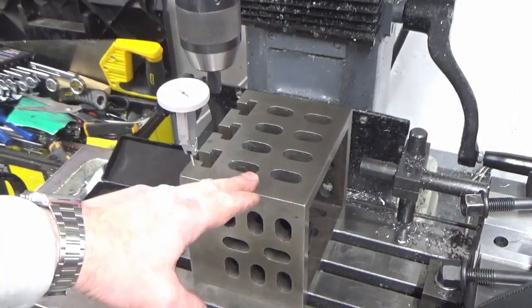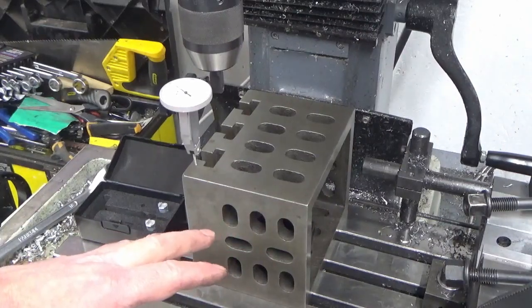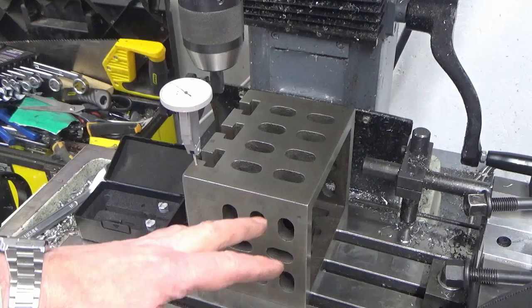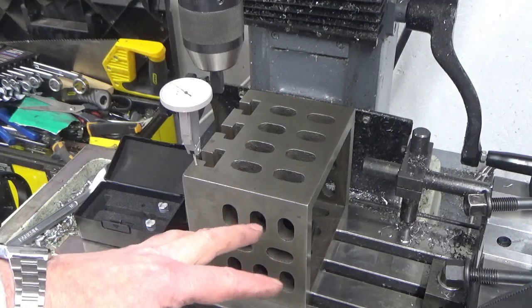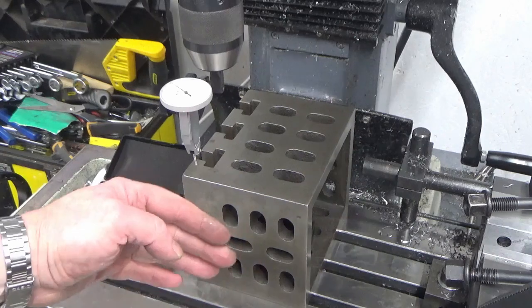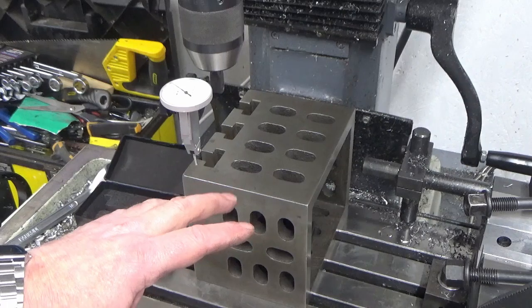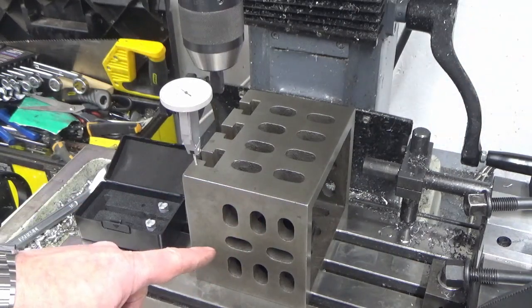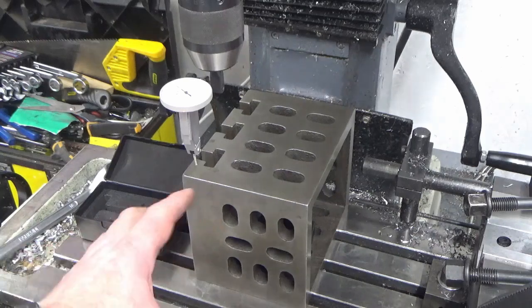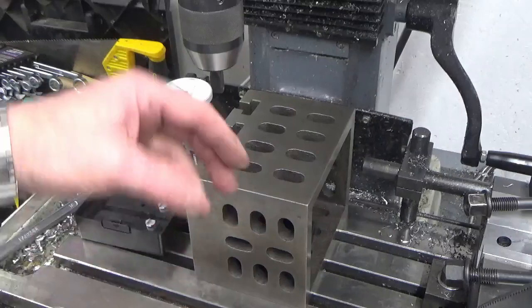Okay, I'm just getting my next setup ready for machining the block, and this I think is probably going to be one of the easiest ways of doing the setups, because I've got about 5 or 6 setups to do where I need the block clamped properly and the vise is not deep enough. So this is a nice way of clamping and gives me some options around. I've got to set it at 45 degrees a few times and at 90 degrees.